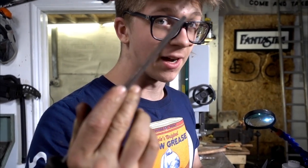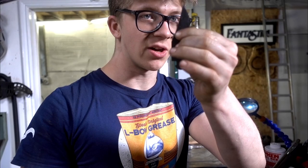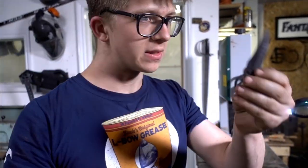The file is hard. If the file cuts, this is not hard. If the file skates, this is.